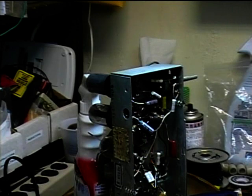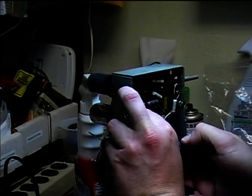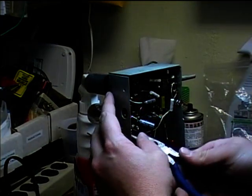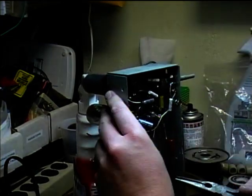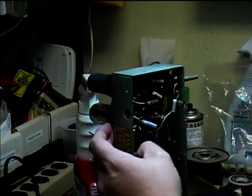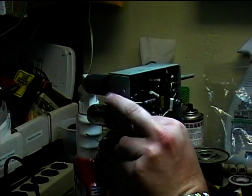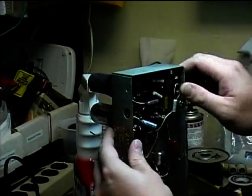So I actually don't think I've got a proper power cord for this here. I salvaged some power cords from some old junk VCRs and things that would be great for this, but I don't have them here. So what I'm going to do is just use an alligator clip power cord to connect power up to the radio for test purposes, and then we'll get the real power cord. I think I've got those cords out at the storage unit, and I trimmed off the old power cord lead, and I'll make sure that there's no loose bits of wire that could short to anything.